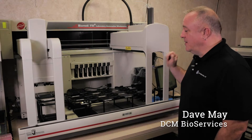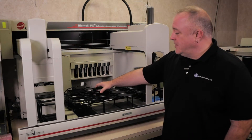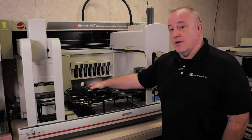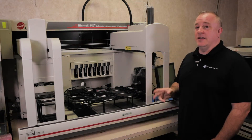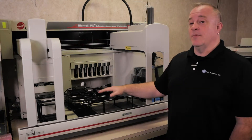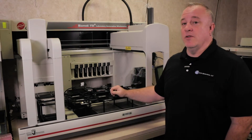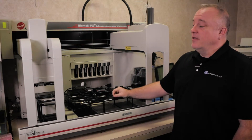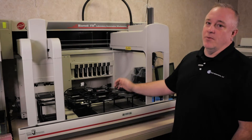For teaching the deck using the Span 8, we're going to need the AccuFrame. Just put it in the position that you want to teach and make sure it's securely down. There are two different ways you need to teach the deck. Anything in the front row is going to be taught using Probe 7, and anything behind that is going to be using Probe 1. The reason is Probe 1 can't reach the position up here, which is why we use Probe 7.